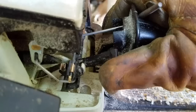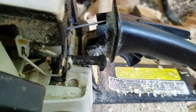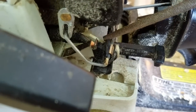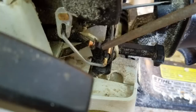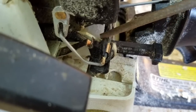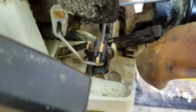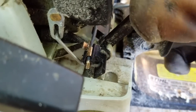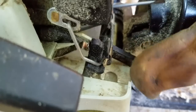What you want to do is take a file — using this little round file here — and you just want to, you can see I've already done it here, just soften that edge, roll that edge a little bit with a file. And that way it'll — see how it runs right up on that ramp like that. Sorry about the airplane.